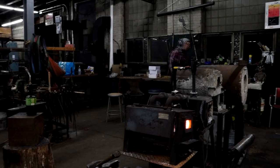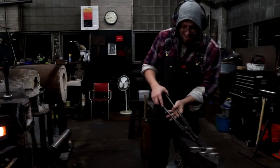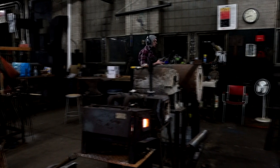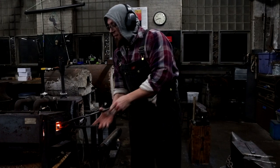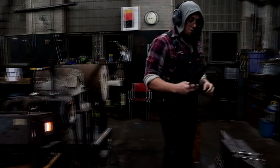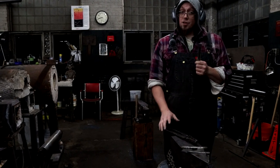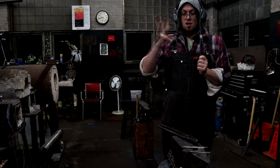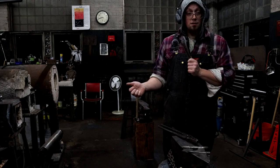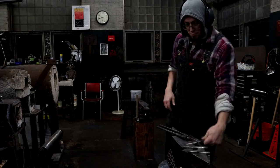Finally managed to overheat one of my D2 chisels. Yay! We're about 90% of the way through the cut, though. It's really not much left. The interesting thing about working with D2 for these things is that it's an air hardening steel. So it got up to a red heat inside the hammer, pulled it out. It is now quenched and hardened. Fairly ridiculous steel. Very, very hot steel. I don't want to quench it.